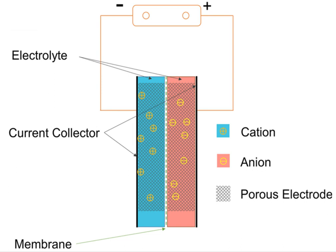Standard capacitors with constant internal resistance fully charge during about 5 tau. Since internal resistance increases with charge-discharge, actual times cannot be calculated with this formula. Thus, charge-discharge time depends on specific individual construction details.